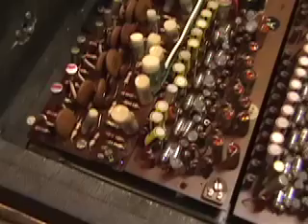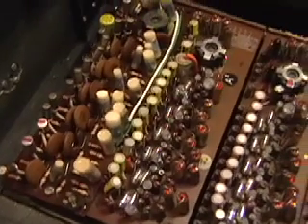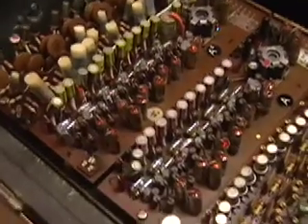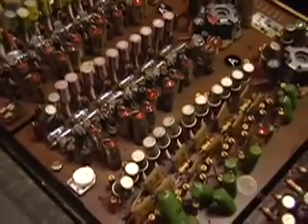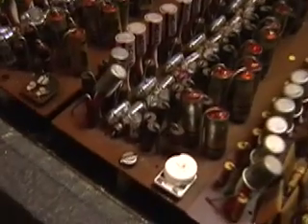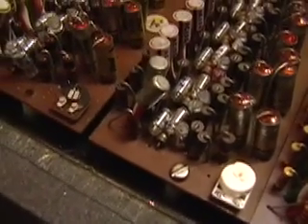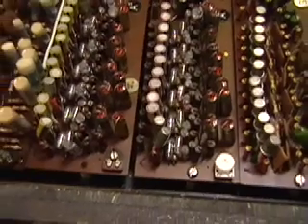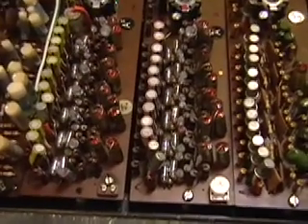The bias pot may make the difference between some of the flip-flops not running and others that are running. You want to choose a value that puts the lowest note through — meaning all of them are running. We'll go to the lowest footage.